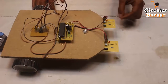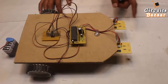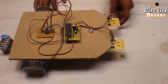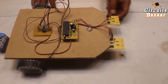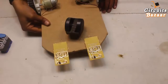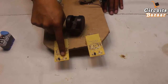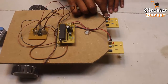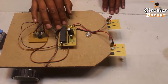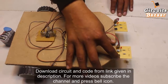The IR sensor circuit diagram is also given in the description. If I talk about how IR sensors work, they work on the reflection principle. If there is a white surface, IR radiations will strike it and come back. One component is the transmitter and another is the receiver — one throws the radiation and another receives it. The received radiations are fed to the IC LM358, which then generates a digital signal. That digital signal is fed to the microcontroller. The second IR sensor works the same way.